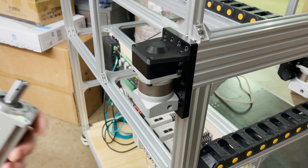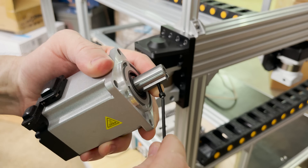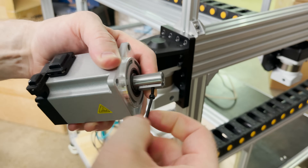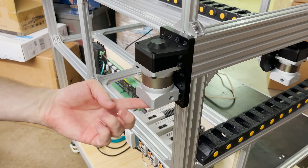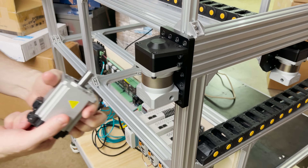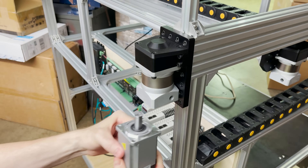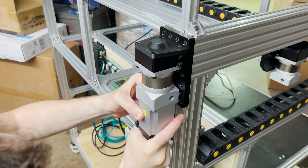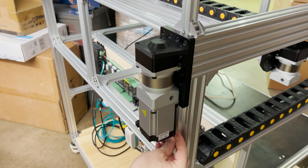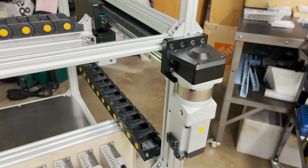Let's start with the right side Y axis. First, we need to remove this key from the keyway — I've inserted an M3 screw in here, so I think we can just tighten it down and pop it out. I've already loosened up the coupler inside here. I've got some M5 by 16 screws and I'll have the cables face inward. That's loosely on there; let's do the other side.